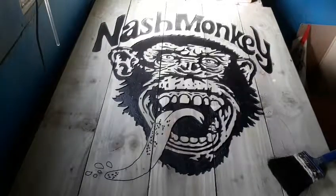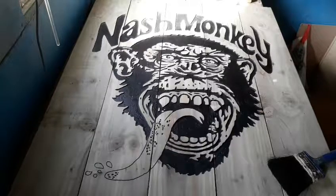I'll continue cleaning this off. I had all intentions of videoing this and doing the old classic fast forward bit, but it took over an hour to get it off - I've really struggled with this and I think it about broke my back. But not to worry, you've got to suffer for your art. So what we need now is a good brush off, then I'll get some linseed oil just to darken this wood down. The wood doesn't need treating as it's tanalised and pressurised anyway, because remember it's an outside fencing panel - so it's already treated. But I'm going to throw some linseed on just to make it pop a little bit more, and then we'll see what the end product's like.